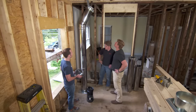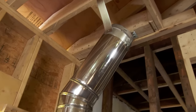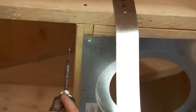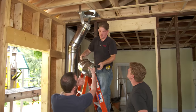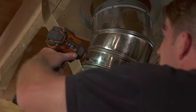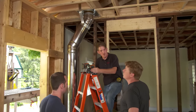So what are we doing today? What we've done is we've got our second floor pipe in place. We've used a pair of offsets to get a little higher up the roof line. We've also had an offset around the ceiling joists. We're going to install some metal shielding at the ceiling to maintain that 2-inch clearance to combustibles. We will then install our offset return so we can penetrate straight through the roof. Now, that's just a twist to lock it? That is correct — we have a twist-lock pipe. We like to ensure that it's secured with a stainless steel metal screw in between the sections just to keep it from untwisting.